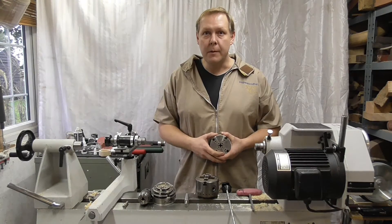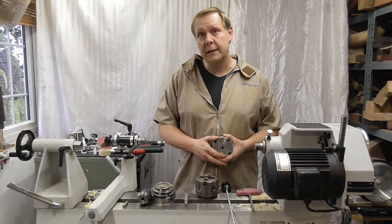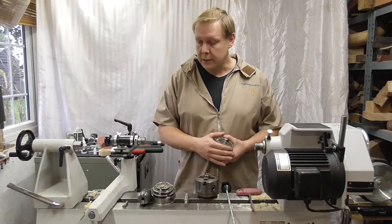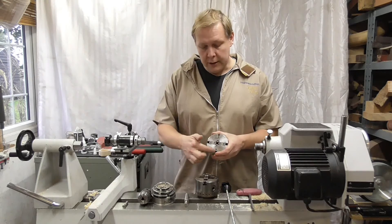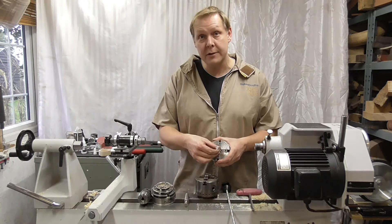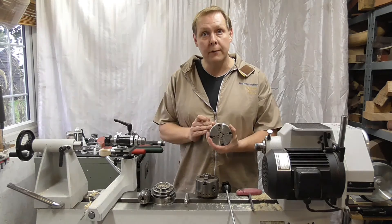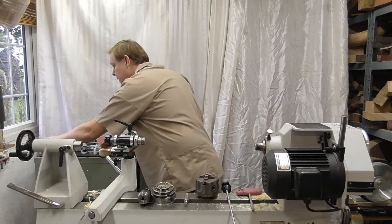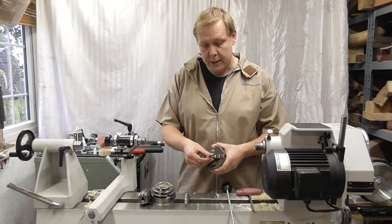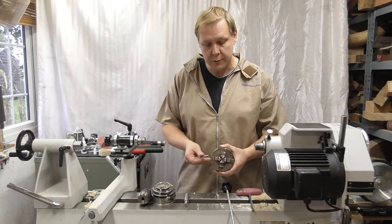The first few tips cover different ways of holding the cutter if you don't have the Morse Taper cutter holder. If you've got a spare chuck, you can take the jaws off and it fits quite nicely in the carrier, so you can use that successfully on a standard small four-jaw chuck. I've also got the engineering jaws, and that works really nicely as well.